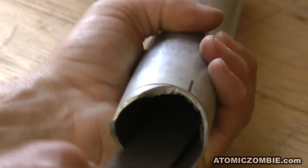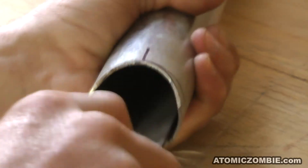The edges of the ground area will be razor sharp, especially inside the tubing, so some hand filing will be necessary. Remove any burrs or high areas using the half round file before checking the fish mouth with the adjoining round tubing.